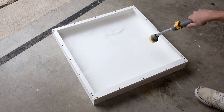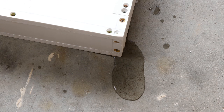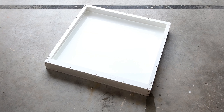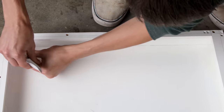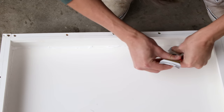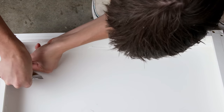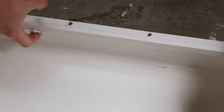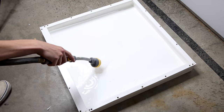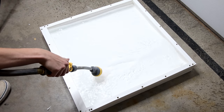Unfortunately, when I went back to do the water test, it didn't hold water. I knew there were a few inconsistencies, so I wasn't surprised. Luckily, I already had silicone as a backup plan. I applied this along all of the seams to account for my errors. Although I'm using this as a solution to a problem, I would recommend using it anyway as a preventative measure, in case the boards shift over time. After I applied the silicone, I evened it out with my finger. I let it sit for the proper cure time and went back for a second water test. This time, it held water perfectly.